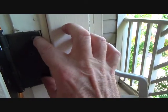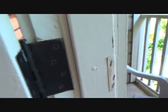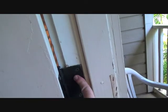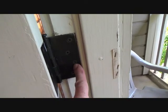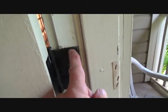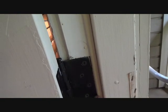But remember, once you tighten up the jamb with your 3 inch screws on the back side, there's no way you're gonna push this in any tighter than the wood. You're not gonna think, okay, I'll just suck the hinge and push it right in, because you can't. The other screw's already in there, it's already holding it. And if you think that you're gonna do it by just putting two long three inch screws here and drive this in and suck the jamb over, it just very seldom works that way, because now you're trying to push this whole thing in rather than a direct screw into the wood behind there. Does that make sense? I've tried it and it really doesn't work.